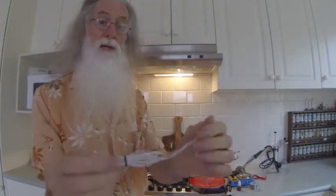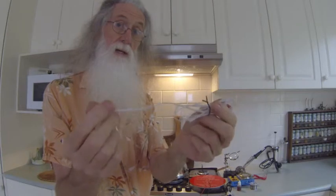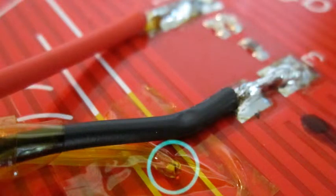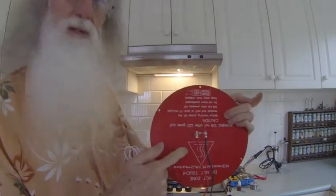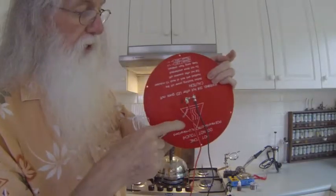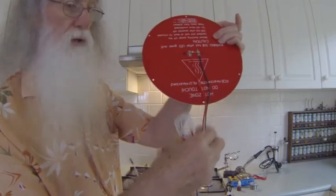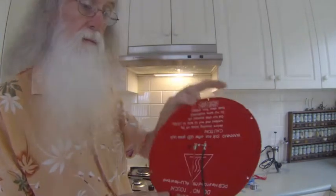You also make the wiring flat because you have to fit the thermistor — that's the temperature probe with a little ball on the end. This particular one comes with a good length; you could cut it and solder it to extend the lead if you wanted. You fit the thermistor to the plate so it touches, then fit it under one of the leads and hold it in place with a bit of kapton tape. Don't use heat shrink because it will melt at maximum temperature — just wrap the lead underneath and use kapton tape.